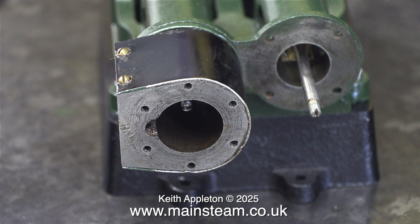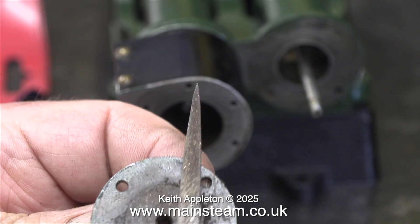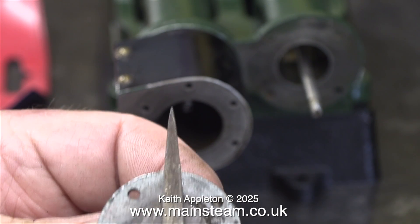I was very pleased with the result — everything was moving very freely. Now it's time to fit the first of the two cylinders. Originally the cylinders were fitted upside down on this engine, probably to hide the crack in the steam chest which I've repaired. I forgot to remove the rust from the inside end of the cylinder cover, so I'm doing it here using a needle file.